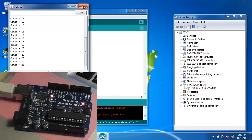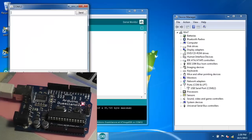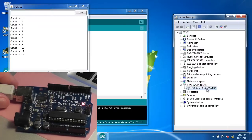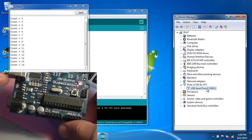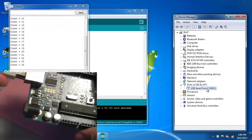So these were the steps. You upload the program to the Arduino by clicking this button. After the upload completes, you open the serial monitor. Then to produce the problem, you verify that it's in the device manager. While the serial monitor is open and collecting data, you physically unplug the USB cable like this.